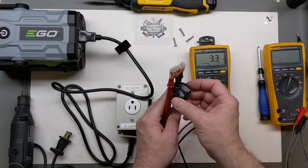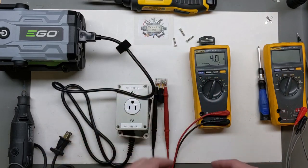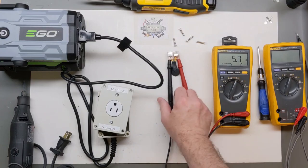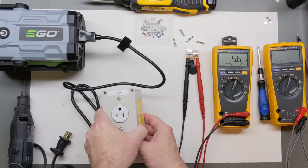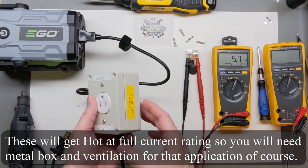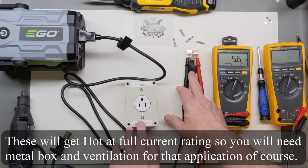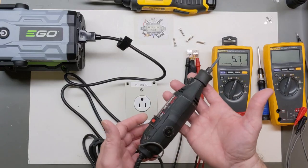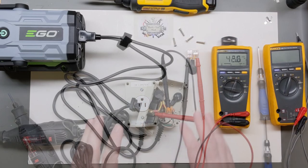I just wanted to show here with some ice that we can cool this down and get some help bringing it back toward 5 ohms. The ice definitely pulled it above 5 ohms briefly — we just want to get it back to room temperature, around 70°F. I wanted to mention the cooling effect: you'd ideally want a metal case with a good heat sink, or good ventilation, especially if you're starting and stopping a load repeatedly. If it stays warm the resistance stays low, and you may get to the point where it's so warm it won't provide enough inrush limiting on the next start.